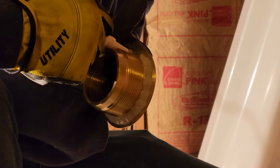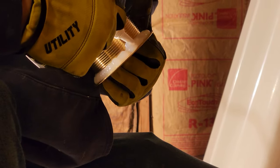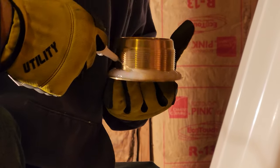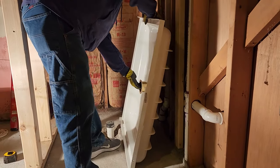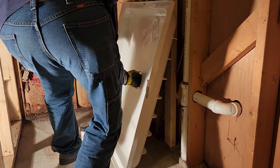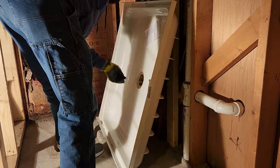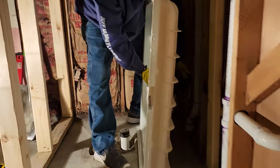You want to apply a bead of silicone around the strainer. Some plumbers will use putty there — nothing wrong with it — but we like to use pure silicone. It works well and we do not want leaks here. This shower base is being installed on a concrete floor. You do not want it to leak, otherwise you're removing the entire shower unit and trying to fix that.